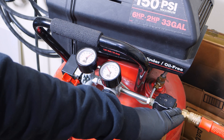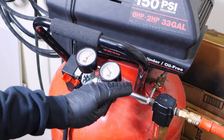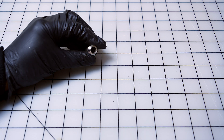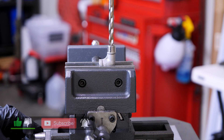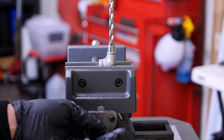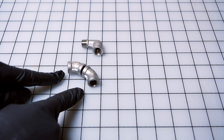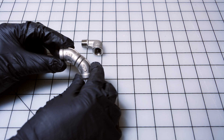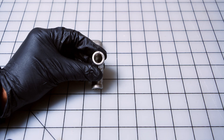Now we're going to replace the coupler after the air filter and get rid of all couplers, since I realized I didn't need them. I went out and bought a 90-degree fitting and drilled it out, but I ended up buying 45s instead because the 90 was just too small. The 45s are bigger, both quarter inch, and both give you 90 degrees. You can see the opening on the 45s is a lot larger compared to the 90.